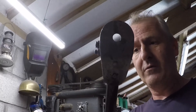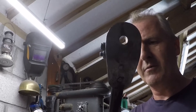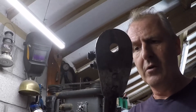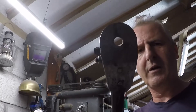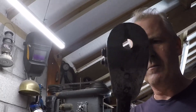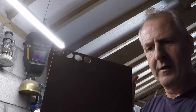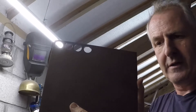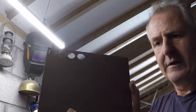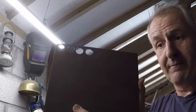It's got a hole in it just for either tying to the back of motor cars when we want to tow fuselages along, or bolting through a shopping trolley caster, which I've used a couple of times when I went to Newquay some years ago. Anyway, having had a ferret around the back of the hangar I found a nice piece of 3/16ths 4130 — the same chrome moly steel — so I think it's time to carve a new skid out of this.